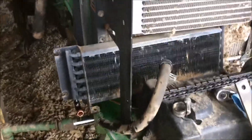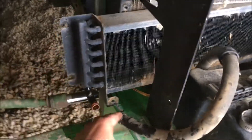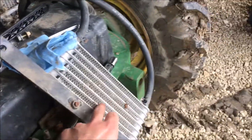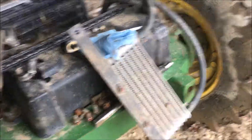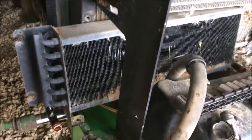Here's the hydraulic oil cooler. There are two bolts on both sides — they're 13 millimeters — and one on each side down here, which releases the bracket with the fuel cooler. Then the two hoses come off and it slides out the side. I'm going to take it and try to flush it.